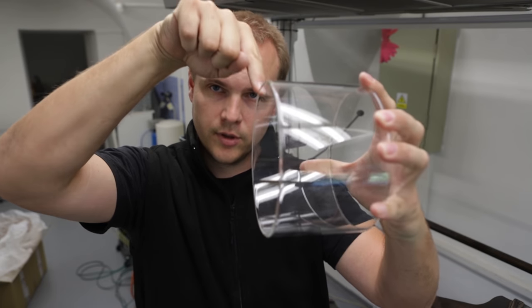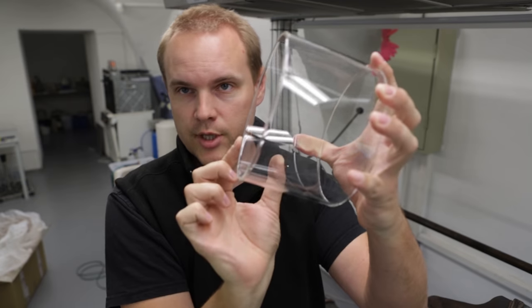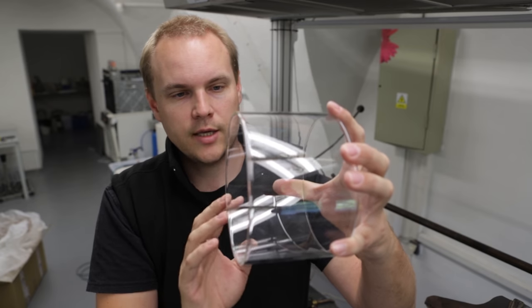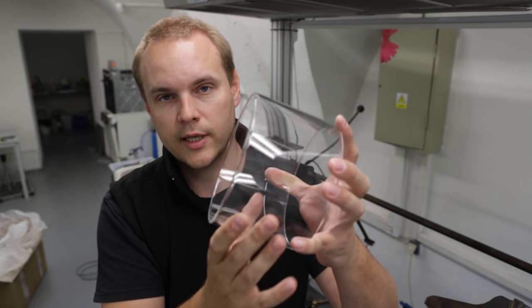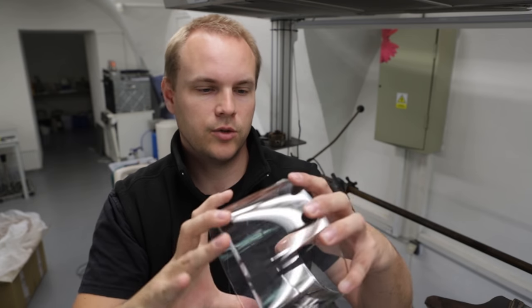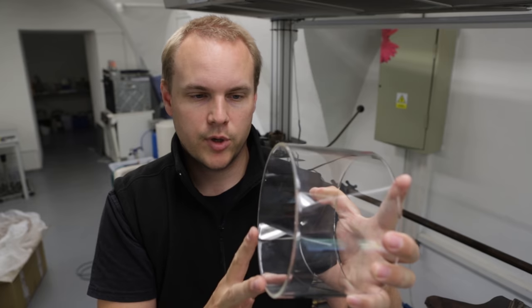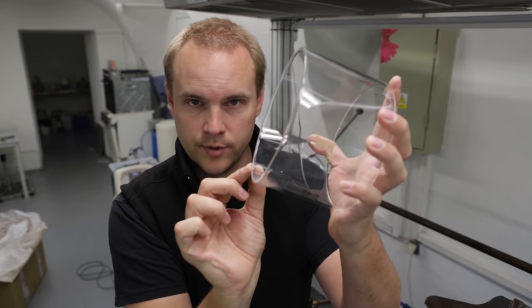If I point the flame towards the glass, it tends to spread and heat a larger section of the glass, and I want to avoid this, because in this case I would heat also the internals, and the internal system is made of stainless steel. It would oxidize and it could get damaged. So I want to use this lathe burner to heat just the perimeter of the glass, like just a thin section, and seal it all together.